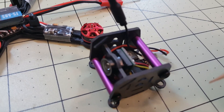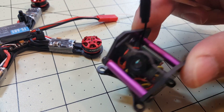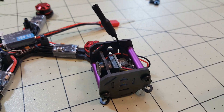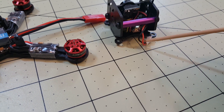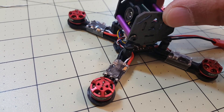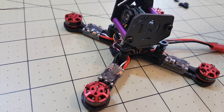This is the camera pod — I have the VTX-03 at the bottom and the camera just sticks in there. I put some sticky foam on top and bottom of the camera barrel to hold it at a slight angle. The camera connector goes right on the back and sits on top. I put some nuts on and we're ready to go.